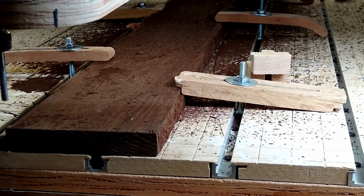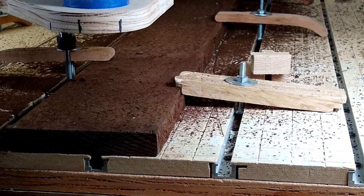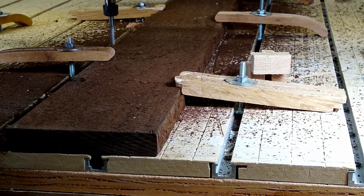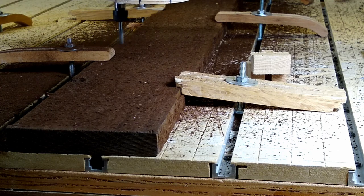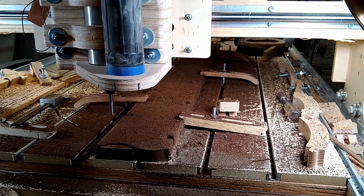On a side note, what I'm using here is red oak but it's been roasted or torrified, as some people like to say. Normally when they harvest wood, they run it through a kiln process to dry it out — wet wood warps, curls, lots of things that are undesirable. So they normally kiln it, and that's great. This process runs it through the kiln longer and hotter, and it turns it dark.